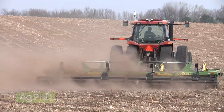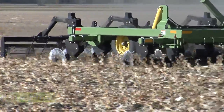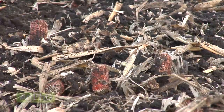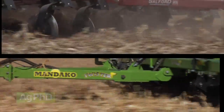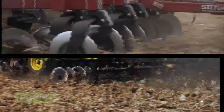Basically what we're talking about is tillage tools that are going straight up and down for the most part. When guys say vertical tillage, what they mean is a coulter cart of some sort — so we're using coulters to do the tillage. It's not the heavy turning over of all the soil; rather it's slicing up residue and maybe turning over just a little bit of soil. Whether it's a Salford or a Twister, there are a number of different pieces in this category of vertical tillage.